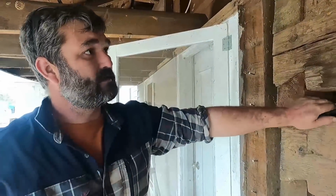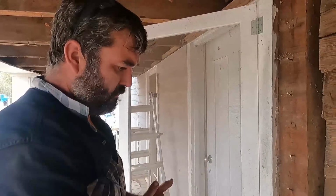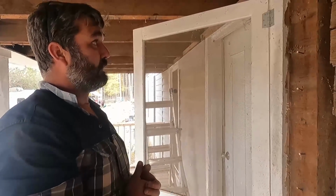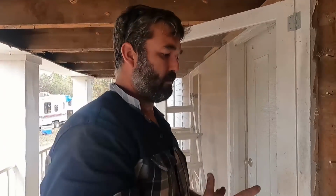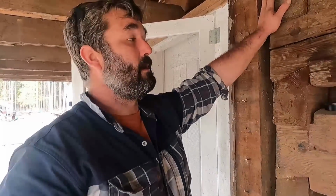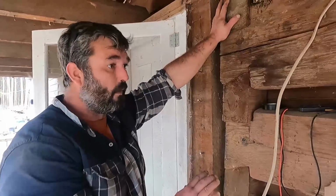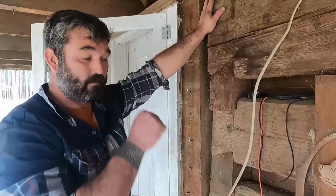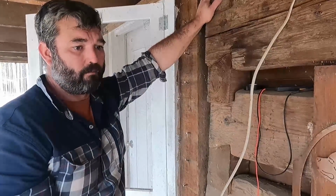All right, and now, like I said, that's not a permanent fix, so don't take that for being a permanent fix. With this, I'll be showing you not much how-to wiring, because unless you really know what you're doing, you want to get a certified electrician. I just want to show, if you were renovating an old house and you came across some wires, kind of what to look for, and at least temporarily, you can check your voltage, make sure that you don't have power going to it, and then put the wires up out of the way while you get someone that really knows what they're doing, or until you have time to get everything wrapped up and out of the way.